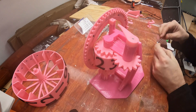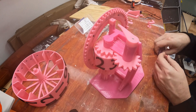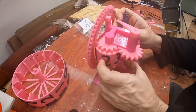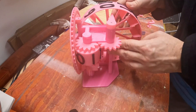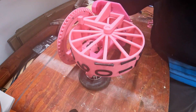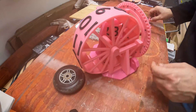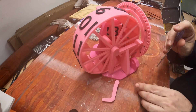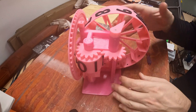You do need to carefully line up these gears. There are two dashes on them so that when they line up, the tens-of-minutes wheel will turn the hour wheel. I mistakenly put the hour wheel on here — it should actually go on after you put on the little arms and install the motor. The two extra little arm parts here help to center the tens-of-minutes wheel and the hour wheel. We'll skip through this so I can show you the right way to do it after I do it the wrong way.